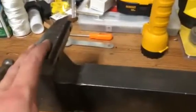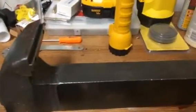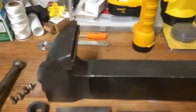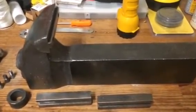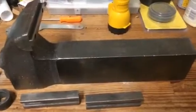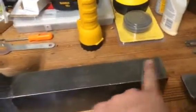On this piece I did not soak, nor did I soak this. I just went straight to the wire brush on the angle grinder, and it did a really nice job. In all, I probably would not soak any of these pieces again if I were to redo this. Your bang for the buck is not there. I did basically all the same work on this as I would have done without it, and these turned out just fine.